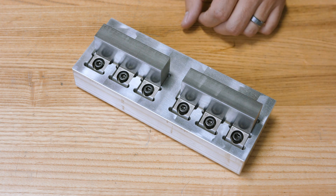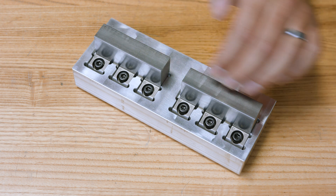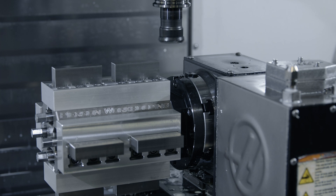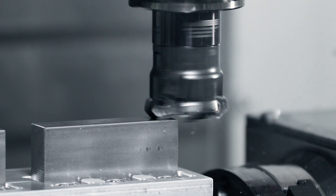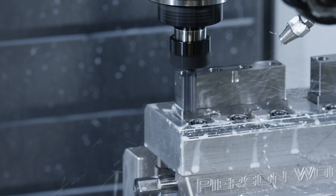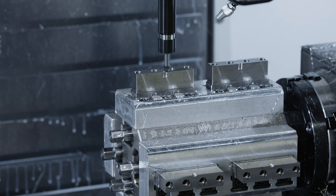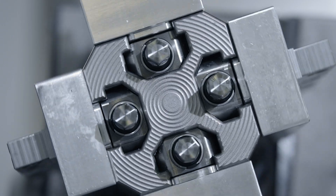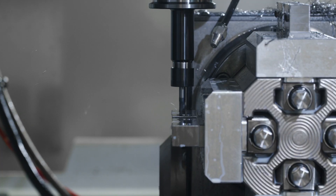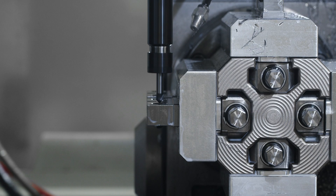Taking a look at the pallet, we're holding two parts at a time on the centerline to maintain symmetry in the setup. We're using three rocker-style clamps per part in the ¾-inch width for maximum rigidity. The A0 position faces the part, drills, counterbores, slots, profiles it, and chamfers the top side. Then we rotate 90 degrees and drill through, counterbore, slot, and chamfer all the features.